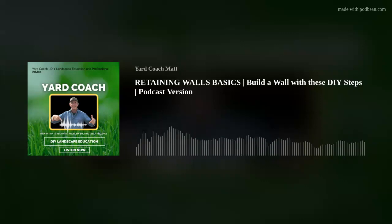And oftentimes the face boards, which are always going to be facing the hillside that you're retaining, you're never going to put them on the front side of your posts. They're going to be on the hillside side. I would suggest doubling them. And if you want something that really extends the longevity of it, take a 30-pound or minimum 15-pound felt or other type of waterproof membrane and cover those face boards all the way down. Make it nice and neat, make it as level as you can, trim off so that you don't see it, and then apply the same process of drainage as you did with the stackable block. Then backfill to the top of your wall.